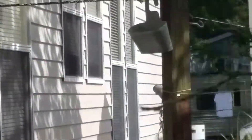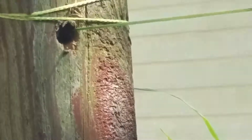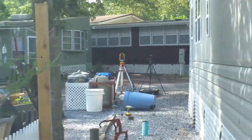We can't quite get the line of sight with a regular cell phone — it's basically a telescope on there. There's a double string coming up though. Those double strings you saw line up with this hole in this post. That hole in that post lines up with the benchmark back here. And there's the string — that's a continuous straight line.